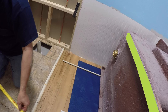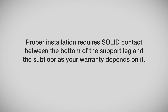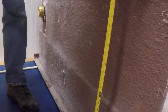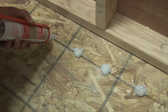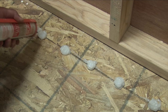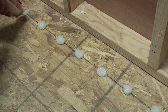The base is manufactured with a built-in back leg support. During the dry fit procedure, you'll notice the base does not sit level naturally — the support leg is cut short to provide adjustment for unlevel floors. Proper installation requires solid contact between the bottom of the support leg and the subfloor, as your warranty depends on it. First, measure the distance from the front apron to the center of the back leg. Transfer that measurement from the previously marked line on the floor and, using a straight edge, mark a line for the back leg. Next, using approximately one tube of 100% clear silicone adhesive, apply every 2 inches on your line as shown. The adhesive should be applied at a height that ensures contact with the base as it's set in place — each bead of silicone should be at least 1 inch or greater. Once the adhesive has cured, this will provide proper support and adhesion between the pan and the subfloor.